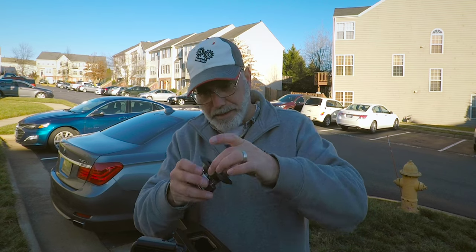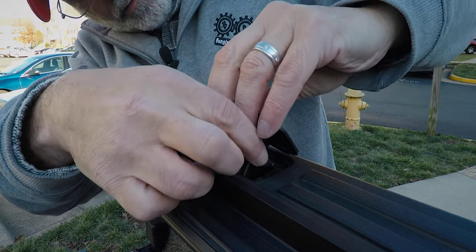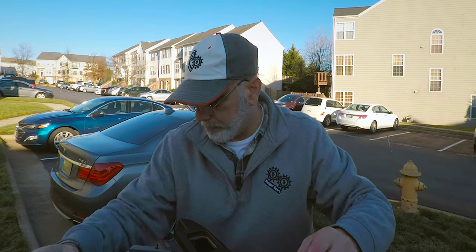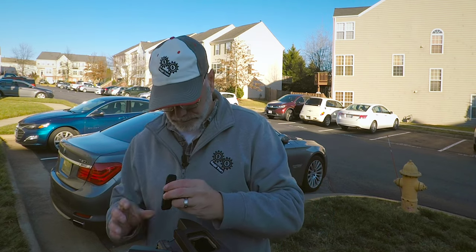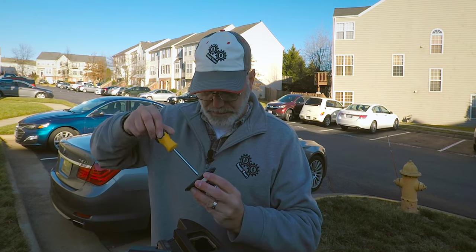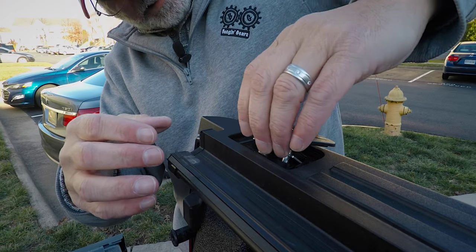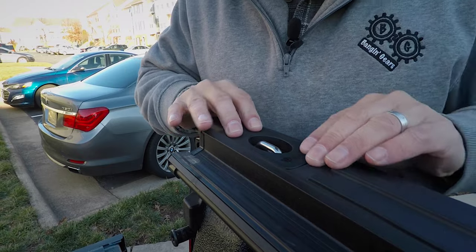What you're going to do is grab it by the top plastic piece and rock it to where it just goes underneath. You might have to play with the screws a little bit to get it over because there's a little lip — you can see it right here where it dips down because of this metal lip, it's a little difficult to get the bull ring in. So make sure you back those screws out just before they want to fall out. Once it's in, you can press it in and then do the screws.